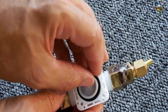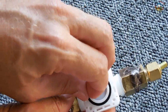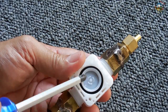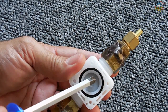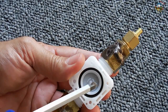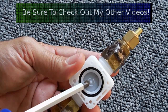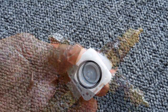When the water pressure comes on, water is going to leak around that little wire into that hole, into this chamber. When it does come in, there's a little hole in the center that's going to let that same amount of water pressure through that opening and out through this opening. The holes are very similar in size, so as long as there's an opening here and an outlet there of similar size, water will flow directly through it and the disk will not have any pressure pushing downward to make a tight seal.